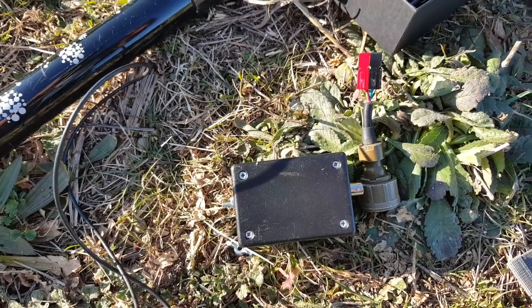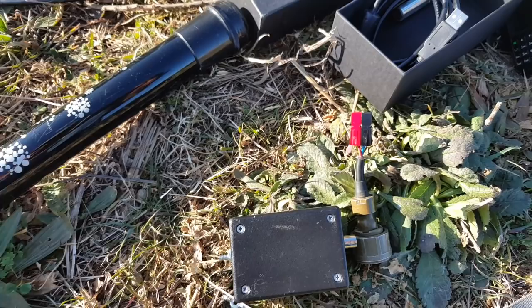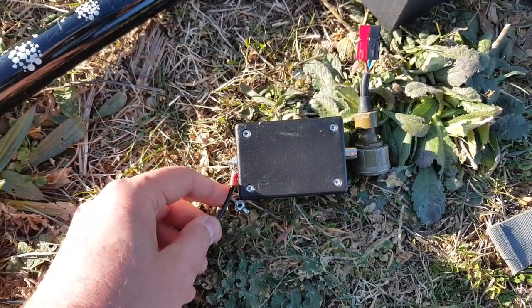And here I brought my VRM-5080, a military VHF radio, on the 6 meter band FM. I really like that radio, and I think a lot of you guys do too, given the comments I was getting on the last video. So let's set it up, and we'll try to make some contacts. I have my 49:1 transformer here. I'll just attach the wire, about 2.8 meters long for a half wave on 6 meters.